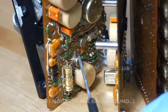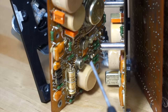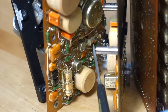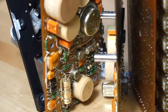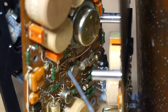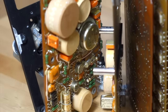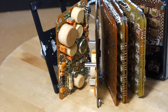So these round chips here are op amps. And these are what look at the output voltage, compare it to a reference generated by the Zener diode. This rather large Zener diode here. Oh, that's a huge guy. That's a Zener? Yeah, I can see the package. And so then the op amps give you pulse width modulation of your oscillations so that if you want more voltage, the pulses get wider, less voltage, pulses get narrower. Okay. Basically, standard switching power supply.